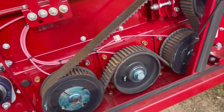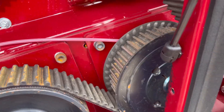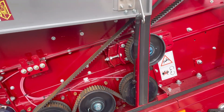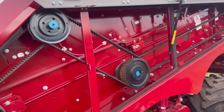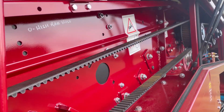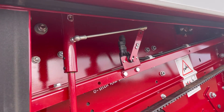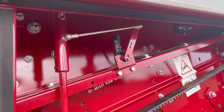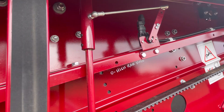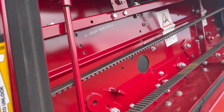You can see also the two hole positions for wear compensation. When the stars start to wear they can be closed. Everything here is in really good condition and this is the sensor for the rear. As you set your depth, if you change the rear up or down then the front of the machine will compensate so that you retain the same depth.